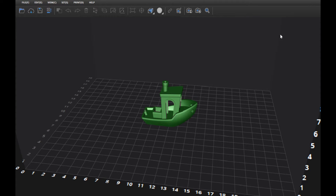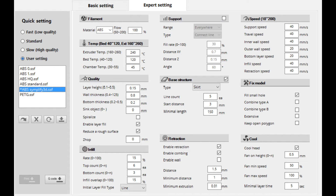You can get the Benchy from Thingiverse. I'm going to change the support speed to 500, the travel speed to 500, the inner wall speed to 500, outer wall speed to 500, leave the bottom layer at 20, infill definitely at 500, and retraction speed we'll keep at 40.